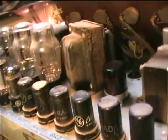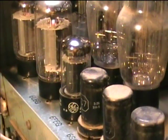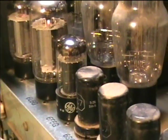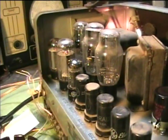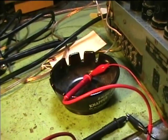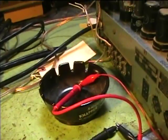I took all the pre-amplifier and intermediate amplifier tubes out and just left the 6F6 in there. I even tried putting in a new tube — a 6V6 — and that didn't make a difference, so it's not in the preliminary stages. I also disconnected everything in that circuit and hooked up a 6V6 sitting in this ashtray to make sure there wasn't arcing in the socket, and we still got the noise.